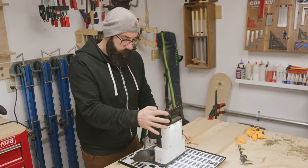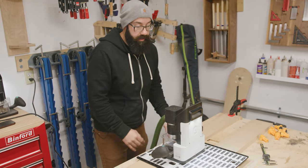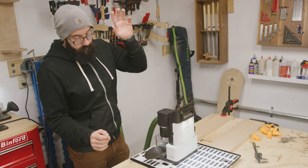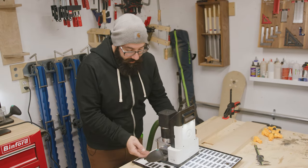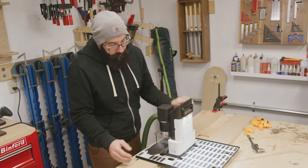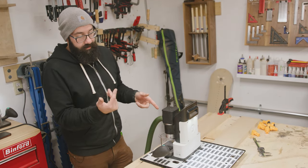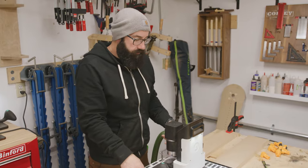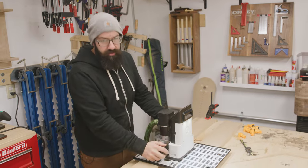Now we're setting the Z height - the height of the spindle. When you set your Z height this thing will automatically touch off. The sensor didn't read correctly because I had it over the edge too much - operator error. I'll pull it back about a half an inch and retouch it, and the sensor will notice it was slightly lifted and now knows the exact height of where the material is. Let's fire up dust extraction, fire up the spindle, and start our first cut.